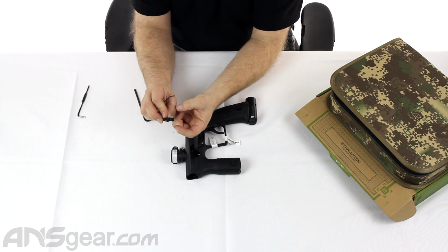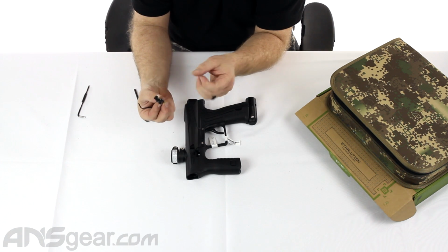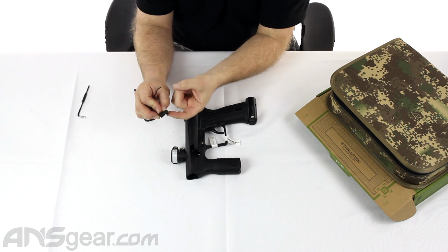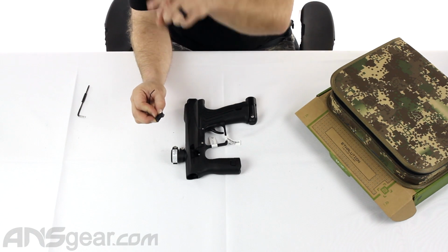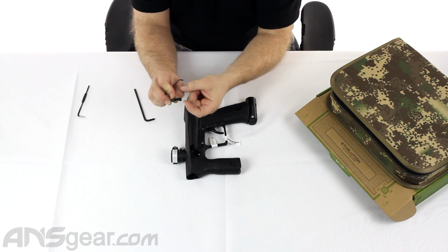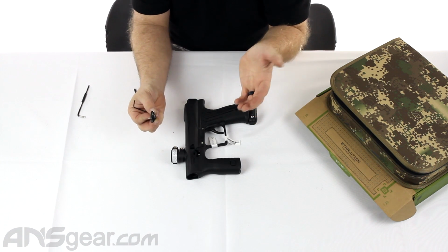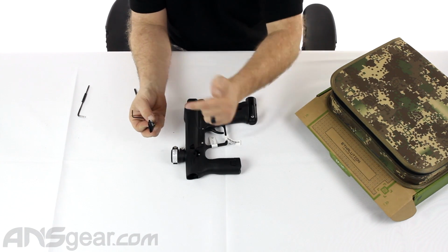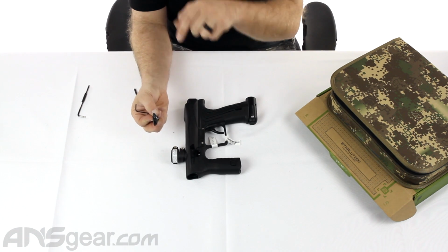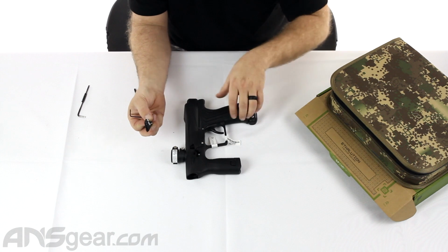So the sensor sits down at the bottom of the window, but because it's a piece of either plexiglass or super clear plastic, it kind of works as a periscope, you know? So even though the eye is at the bottom, it can see up at the top because the light will transfer, almost like a fiber optic cable. So the eye actually doesn't sit up in the breech per se, it sits down below it, but can see into the breech because of this plastic transfer of the light going through there.